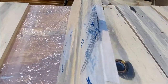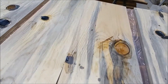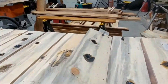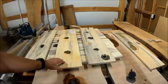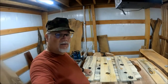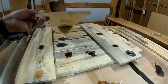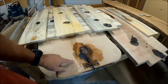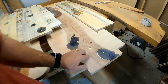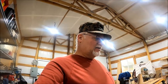A little blowout there, but that's okay — that'll clean up fine. It is a little bit low, but again, that's probably just fine. We're going to let that finish drying. All of the wainscoting that we put the epoxy in — you can see it's really working good. While we were at it, we did the coffee table. Had a couple spots I needed to do. This is all going to get planed off, and we'll have to do a little fill with some wax on those spots, and that's okay. While the epoxy cures, I'm going to get back to planing.